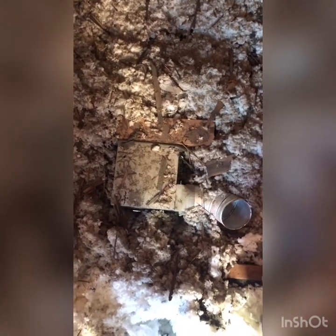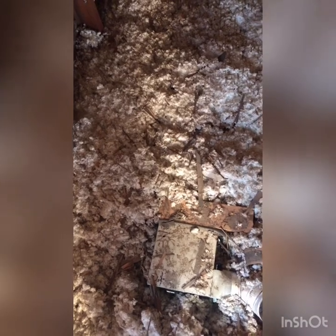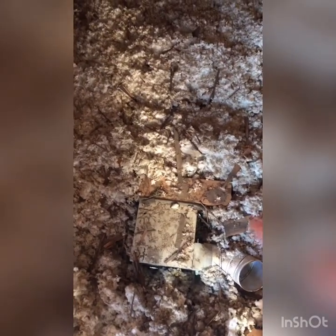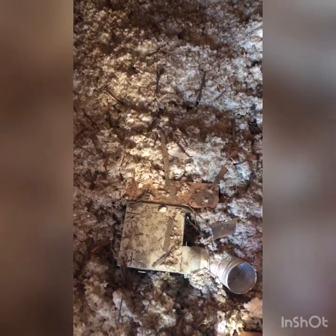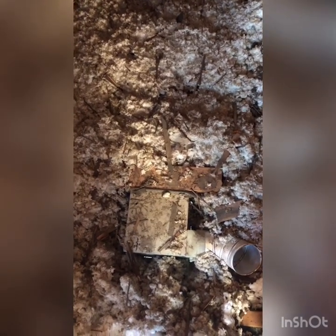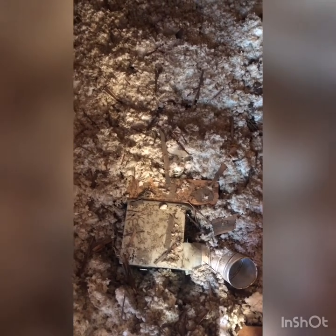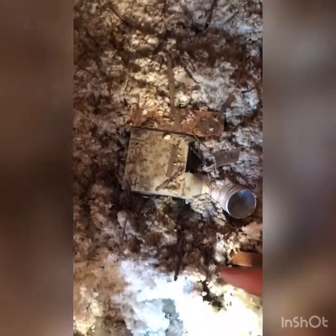As you can see, they've got a block right here and that's good news because the joist is about another six inches away, so we've got some room to make the hole a little bigger. That way we can mount the new fan with that block there, which is good. We also have a little bit of room to come this way too, so that'll be good.